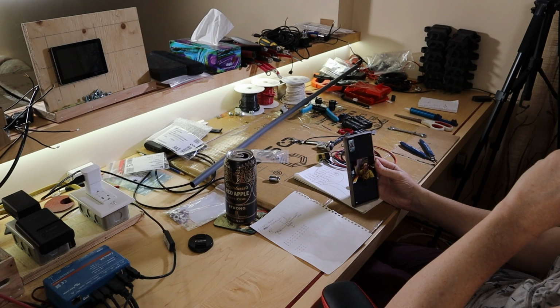And nothing ever goes down to zero and flatlines. That's not how it goes. Yeah. There's energy that's dissipating. Even a voltage spike on a digital signal has ringing. Yeah. Because there's inductance in there, right? Nothing just stops; it goes below ground, overshooting a little bit. And that's what you have to protect your circuitry from.